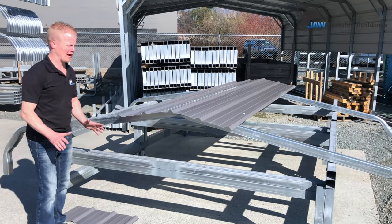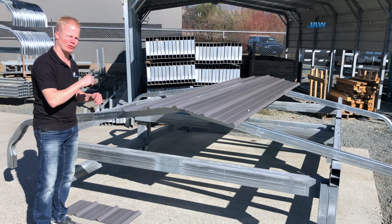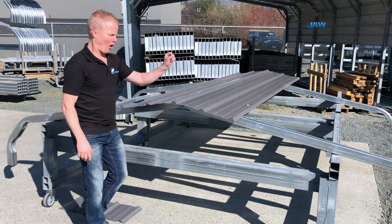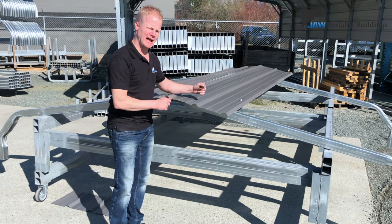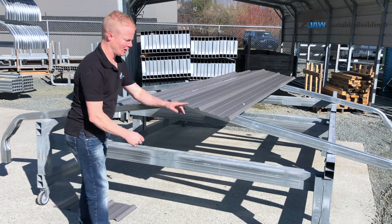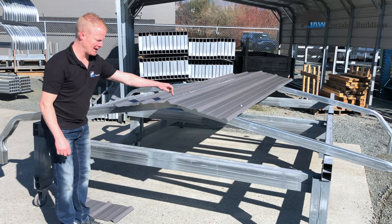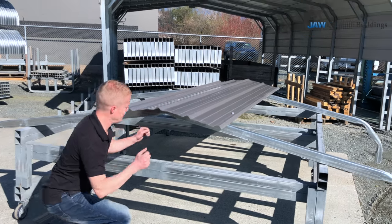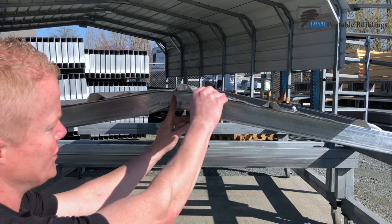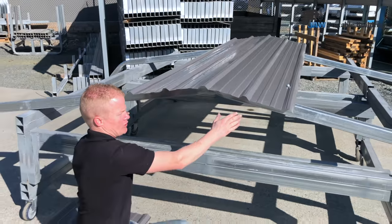Now you're ready to put your cladding onto your frame. Set two step ladders up — one at the front side of the building and one toward the back. Grab that marked sheet and transfer it up onto your roof. All those marks will line up your rafter so you know exactly where each rafter should sit. You're going to have one, two, three, four, five high ribs on the sheet — the very center is the third rib. That third rib goes dead center on the rafter, keeping everything parallel and plumb. Your very first sheet starts in the dead center.